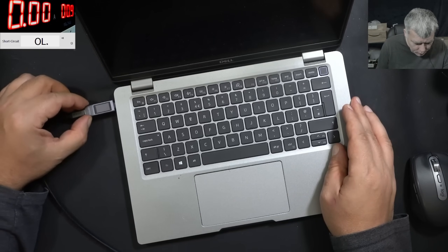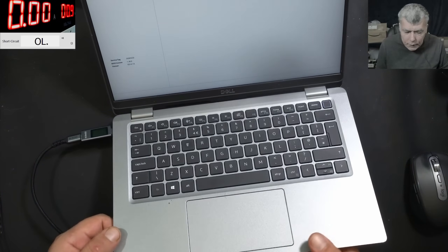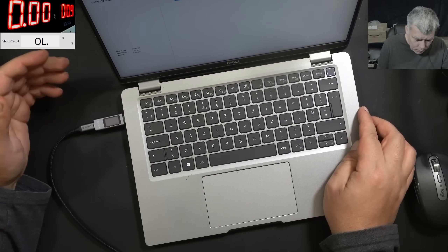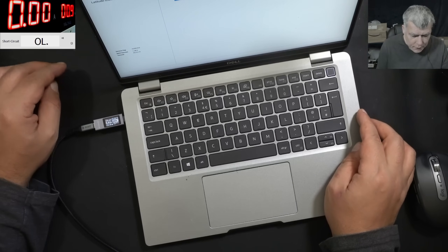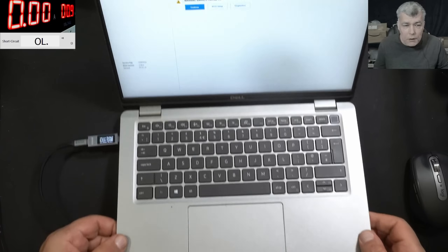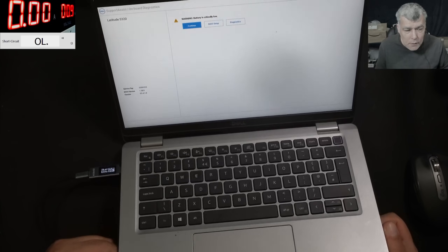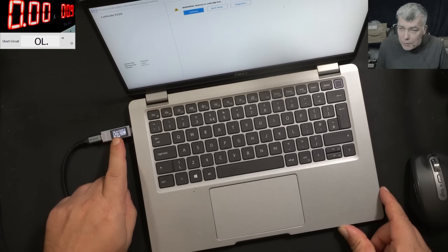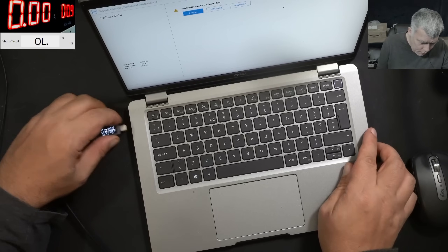This one port is not working and the laptop is coming on with a battery critical low warning. On the other port it's taking 600 milliamps — so that port is working. But the customer said it's not working on theirs. You can see here it's taking 1.8 amps — so on this port it's working fine.